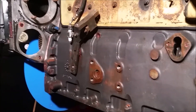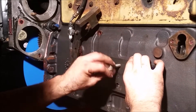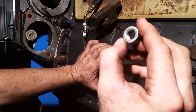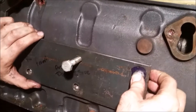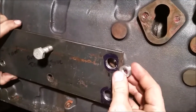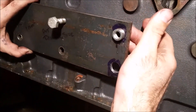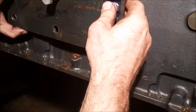We're working on my brother's block. We take this M12 nut — we've rounded it off to about three quarters of an inch round when you take and round all the points off. We've drilled the hole out to three quarters of an inch, and then you beat that nut in there flat. It's gonna protrude out the backside a little bit, but then you grind those threads down and run a weld around the front and back, and clean up the front so you get a nice solid fit and it won't come out.